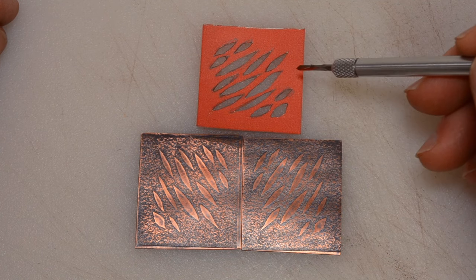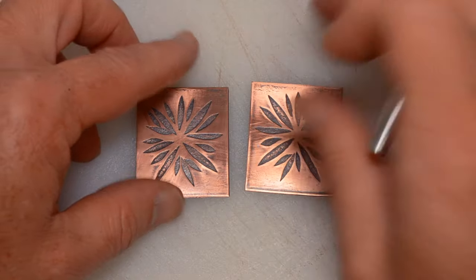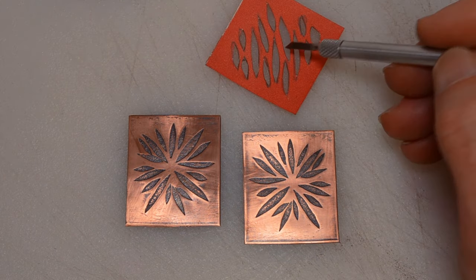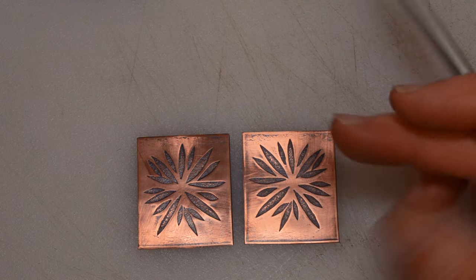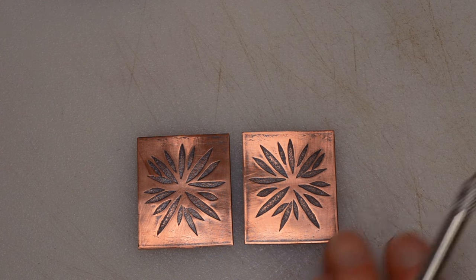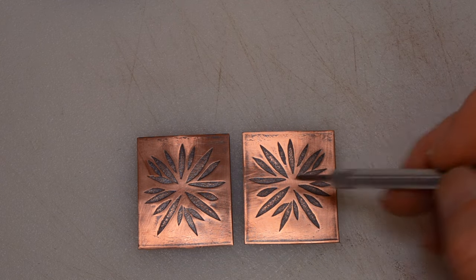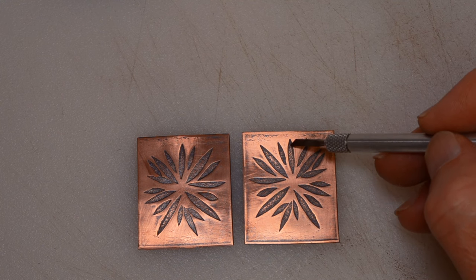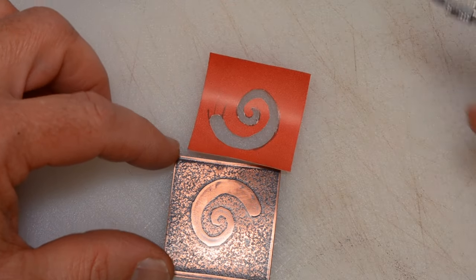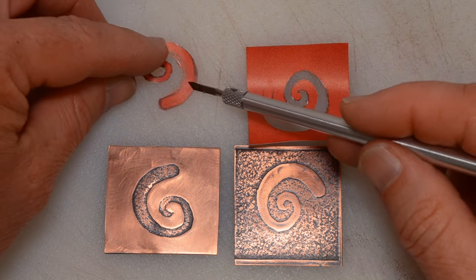This is really cool because you can use artisan papers, homemade papers, to get some really beautiful textures in your metal. Let's take a look at a couple others. This was actually made from the cutouts of the texture plate. I laid them out on one plate, took a glue stick, put it on the other plate, and then set the plate on top so the pieces would stick to the glue and remain in position. After the glue set, I ran it through the mill. Again, you can see the texture of the paper. Here is the spiral design that I did, and here is the reverse image of it, utilizing the spiral itself.